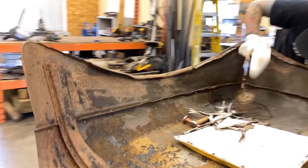Okay. Now, if you look at the front of this hood here, this piece looks like the hood kind of comes out like that. This piece obviously got flattened out and damaged when it ripped off of here. So we're gonna have to bend this piece back, fix that flange a little bit so that it can come back together here. This is just the preliminary first go around, just to overall try and bring as much shape back as possible. Try and line up where damage could have cracked or ripped apart. We'll try and get as much of the shape back as possible and then start fine tuning all these little dents and going over it. But the initial dent removal can happen pretty quick. I mean, we got quite a bit out already and we're gonna just keep going.